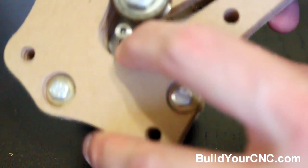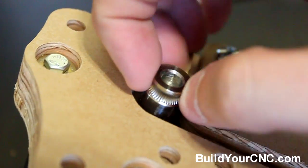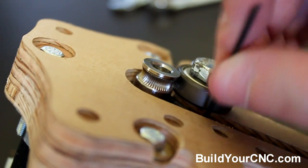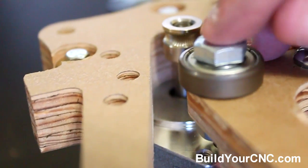Now we need to install the serrated hub onto the shaft of the motor. When putting the serrated hub on the shaft, we want to position it so it'll align with the bearing. Go ahead and press the bearing against the hub and allow the set screw to be located where you'll be able to tighten it, then tighten the set screw. Once it's tight enough, you can tighten the rest of the way on the motor without the aid of the bearing. Now we have good alignment with the bearing and it still clears the set screw. Be careful that the 5/16th inch bolt is clearing the motor; if it doesn't, just add washers between this bolt and the bearing.